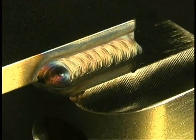This is what I hate — three or four pulses a second. This makes me want to quit welding. It's hard to focus on; you can't figure out when to dip rod. It still turned out pretty decent, but this is your brain on drugs. Three or four pulses a second, and even up as high as ten pulses a second, it's just hard to focus on. One pulse a second is better — you can move the torch along and get in a rhythm. Get in a rhythm; you can do something with this.